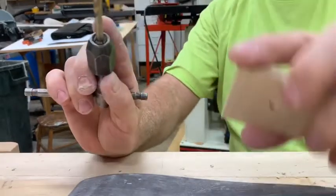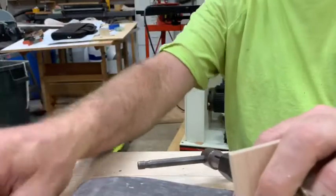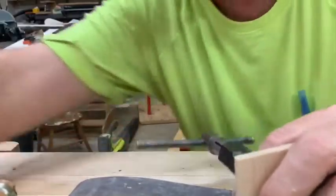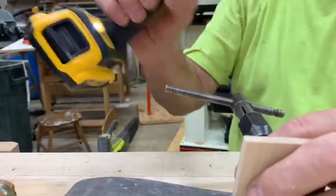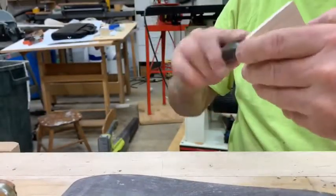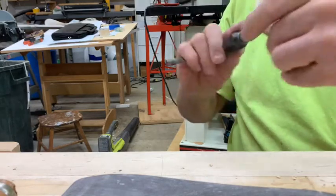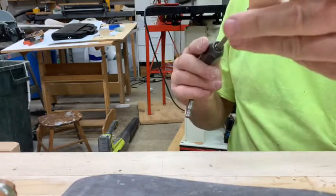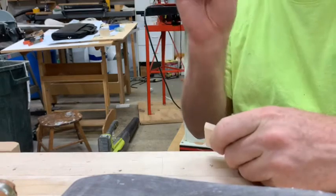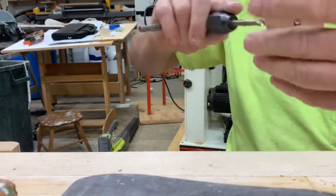Now I've got, I did a few experiments. I tried using my chisel. I tried using this countersink. I tried using the same drill bit with this just to kind of ream it out, and all the right size drill bit, the whatever 64ths I said, did was make the hole bigger. So immediately shut that down. So I'm using a quarter of an inch, which is a step down from this hole, and it's cleaning up the hole pretty nicely